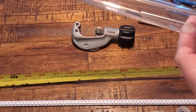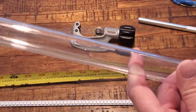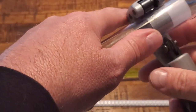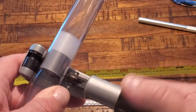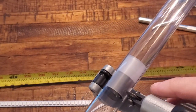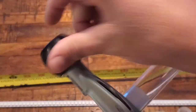into the blade to our mark, which you can see right there. And I'm actually going to put the metal of the blade plug in under the mark. The metal of the blade plug is now in under the mark. So now I'm going to take our cutting wheel and get it on our mark. The reason I do this is it keeps that 7/8 inch plug from compressing on the cutting tool. It looks like we're on the mark pretty good there. There we go. And now I'm going to cut our blade.